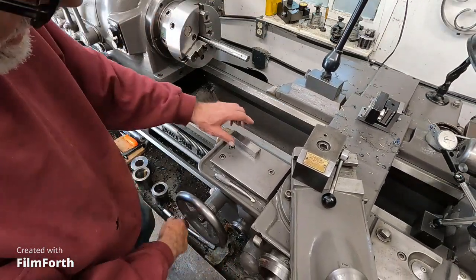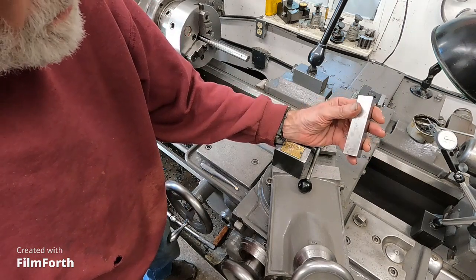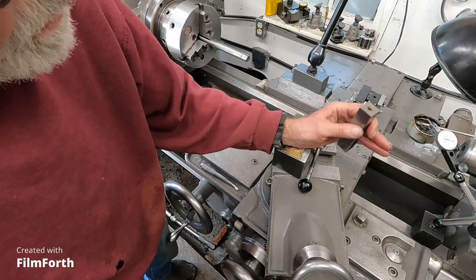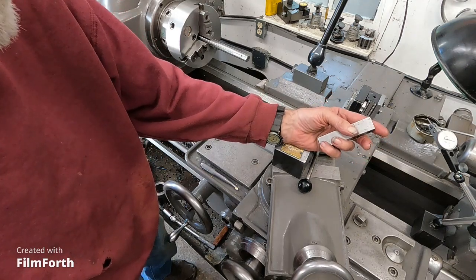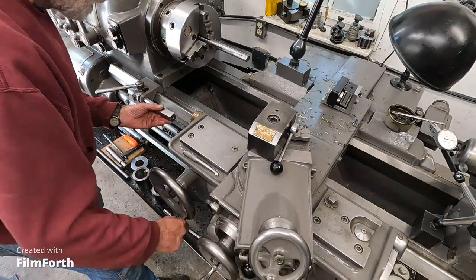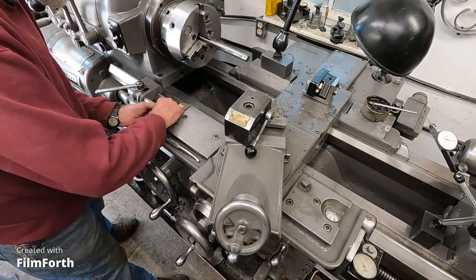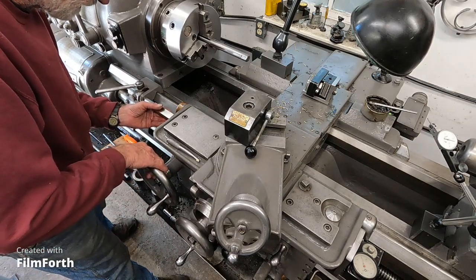Okay. So what I have here is a 4-inch square gauge block, an old kick around gauge block, got fingerprints on it. I think I bought this on eBay with some other square stray gauge blocks for pretty cheap. And it's still very accurate, even though it's been kicked around, and it's good enough for this. So I got the carriage stop here. So you bring the carriage up. You can use a micrometer standard, but I find this big square block nice. You can use a 5-inch standard. I think it's what a lot of people use. But this is a 4-inch gauge block, and it's good enough. So I got that gauge block wiggled in there.